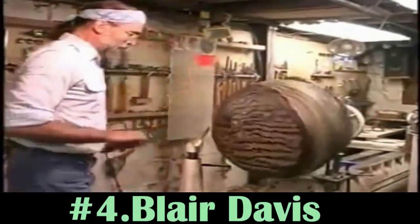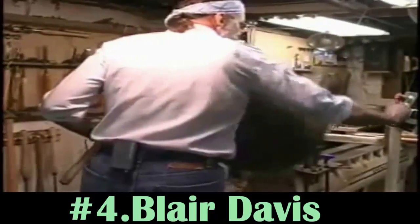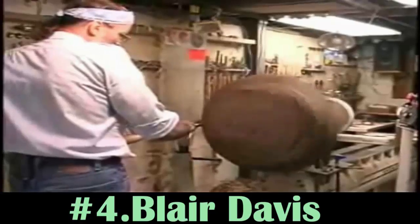Okay, we're a little more in balance now, so I think we can probably bring it up a little bit more. I'm only running this at about 250 RPM at this point, so it's still turning fairly slowly. You can probably hear the difference in sound, how much longer there's more sound being made during the cut than there is during the gap between it, which means we're getting closer. But out here, it's still just cutting on the corners, because I haven't really gotten all the way to the end yet.